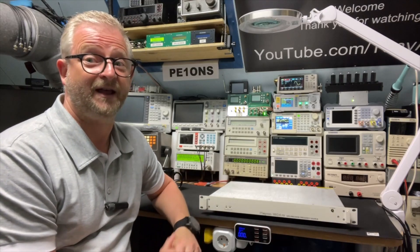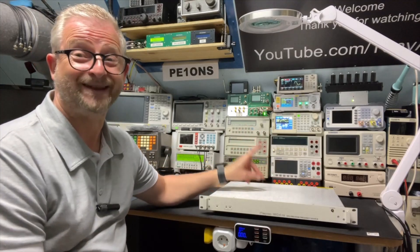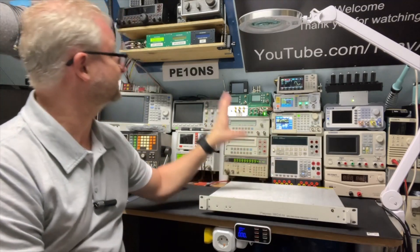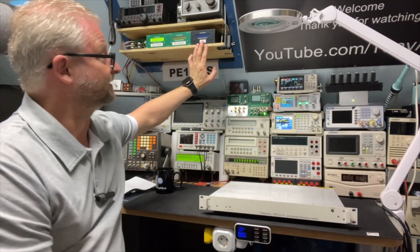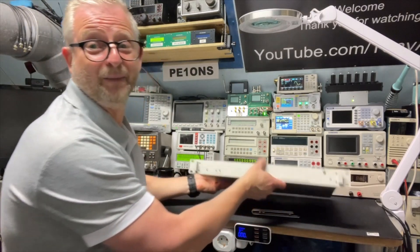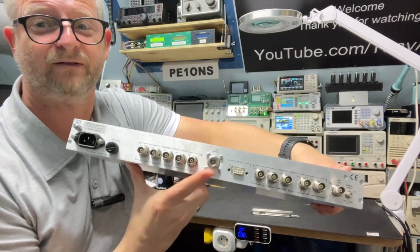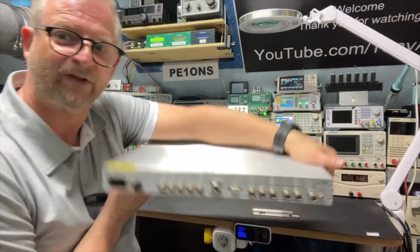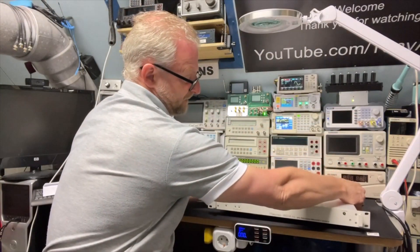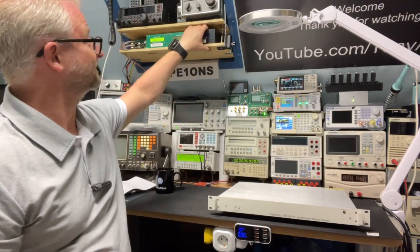I think the M version has one output at five megahertz, and the L version has five outputs at five megahertz. But this one is the P9 — five outputs at 10 megahertz exactly — and also five outputs with one PPS TTL level. This is the biggest, it's a 19-inch unit, with a big N connector for the GPS, sine outputs, and TTL outputs.